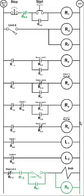Okay, now we know that when the cylinder does go out, it energizes this, and this then becomes open because it's a normally closed contact, so it becomes open, and then it terminates the holding circuit. Once the termination of the holding circuit occurs, this de-energizes, and because it's a spring return solenoid valve, the spool goes back and it sends the cylinder back. So the cylinder starts to retract. So are you with me here? The cylinder is now retracting for the second time. This guy has been latched, and this memory is telling us that it has extended for the second time.